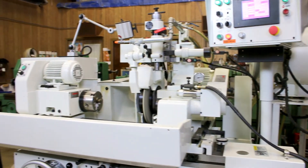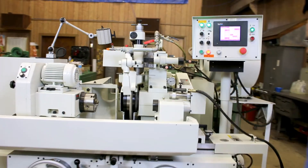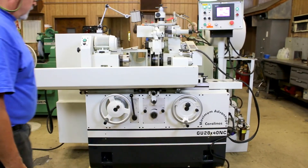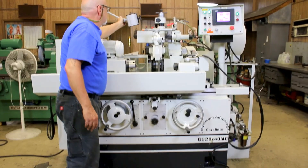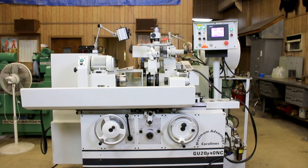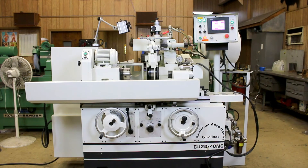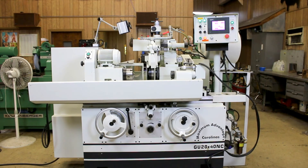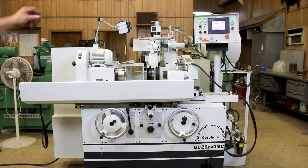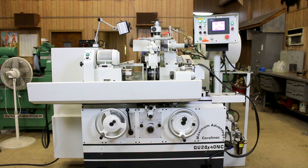We have the manuals on the machine. This machine is currently wired at 230 volts. There is a machine lamp up here and that's pretty much it — it's nice and quiet. You can also dress that wheel by hand if you prefer. You can just loosen the clutch at the top of the spindle, the thimble, and feed the diamond down on your own.